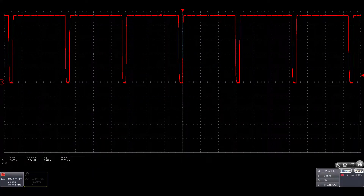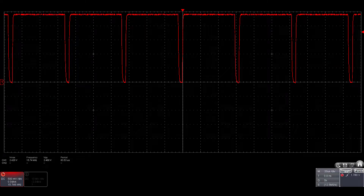Let's first look at the C-Sync signal. This picture shows the C-Sync signal connected directly from the Super Nintendo to the oscilloscope, and as you can see it is as clean as you can expect. The next picture shows it through the SCART switch — it is really the same as the previous one with just a little bit of noise, which is not much of an effect.